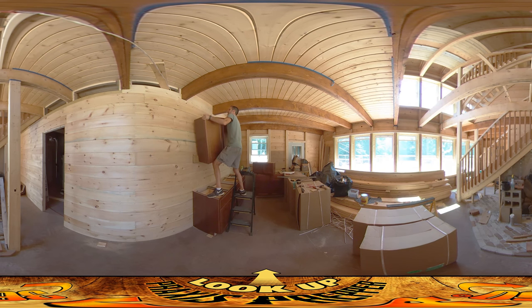This would be easier with two people, but I just got me and that's okay. I'm looking around on the side here — I drew a line where this needs to come to. Bouncing it along... I went too far. That looks pretty good right there. I'm going to hold the front and sink these screws in. And these are lined up with the studs.